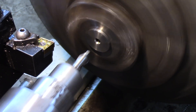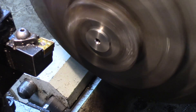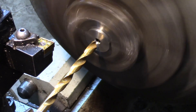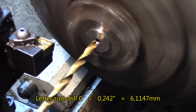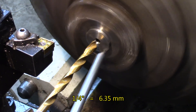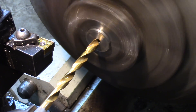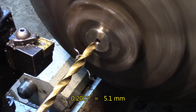Not very much bigger than this — that'll be more than sufficient. For this I'll be using a 242 thousandths drill bit to eventually insert a little piece of one quarter of an inch stainless steel rod here — same material as the base material. So let me just drill this. I'm going to drill about maybe 200 thousandths or so — that should be plenty enough.